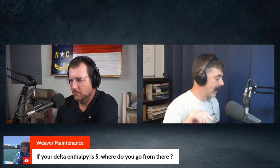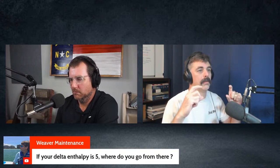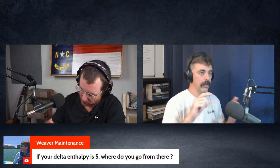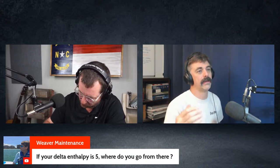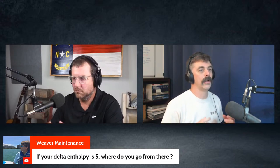Now, let me back up. So what is delta enthalpy? Let's ask that question. Delta enthalpy is the total amount of heat that is in the air. Enthalpy takes into account your dry bulb and your wet bulb, or your air temperature and the amount of humidity that is being removed by that coil.